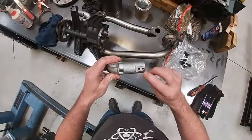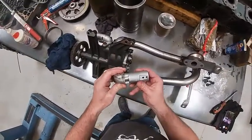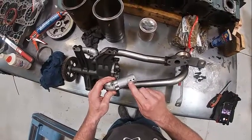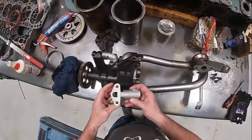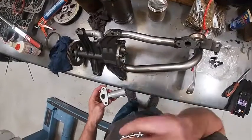This is the oil pressure regulator valve, and this would be the oil pressure relief valve over here. They look the same except the roll pin is out here rather than here. The relief valve roll pin would be back farther because it's a higher pressure. On the oil pump, we could take this apart and inspect the gears inside if needed.